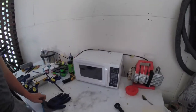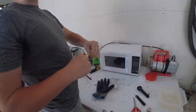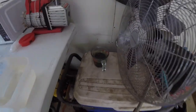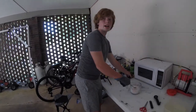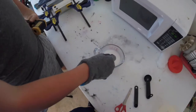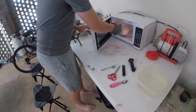The plastic just finished so we're going to open that up. This is where you need a glove to grab the hot cup. Always keep your stuff clean - I've had mistakes where we accidentally put in the wrong colors and made the wrong kind of worms. After two and a half minutes in the microwave, you want to stir it up and have a heat gun ready. I just measured this and it's around 221 degrees - your target temperature is about 350 - so I'm going to put it back in for another two minutes until it's clear.